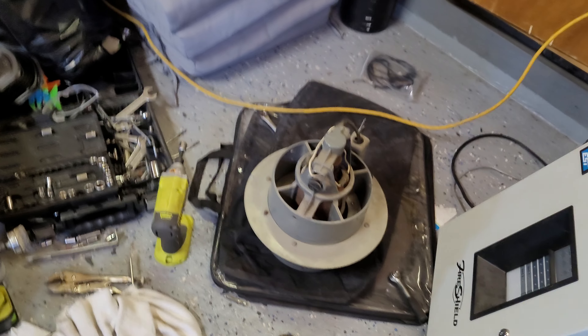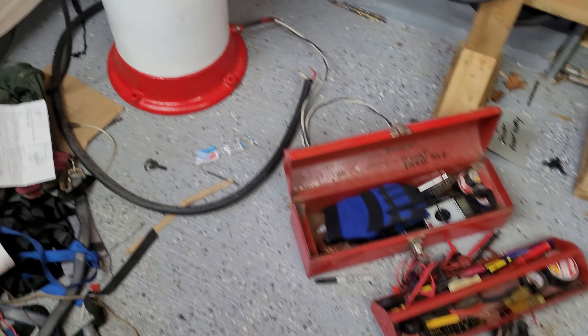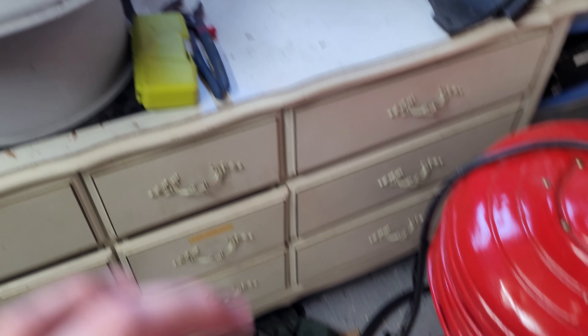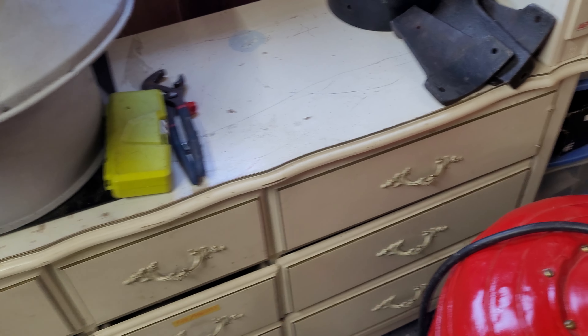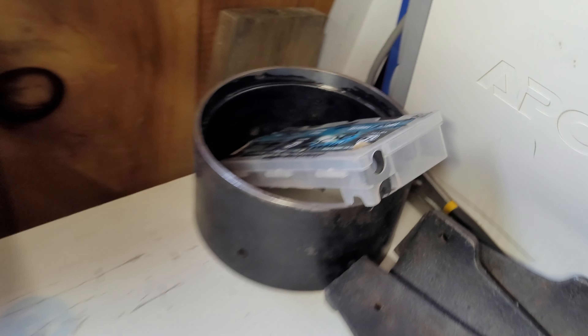I had a little tough time getting the tube off of it, so I just WD-40'd around it and took a long screwdriver, then tapped with a hammer to push the tube off, going all the way around — turn and turn and then hammer a little bit. So all that tube came off. As you can see here, there's a lip right there to put it on.